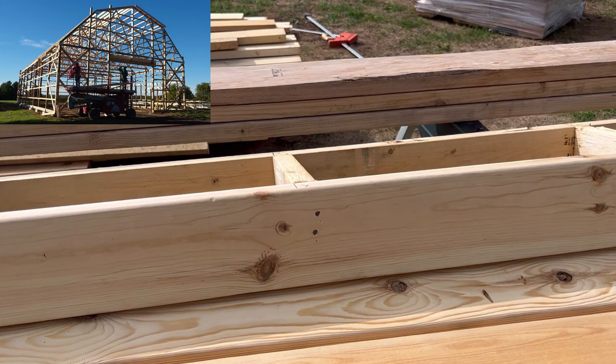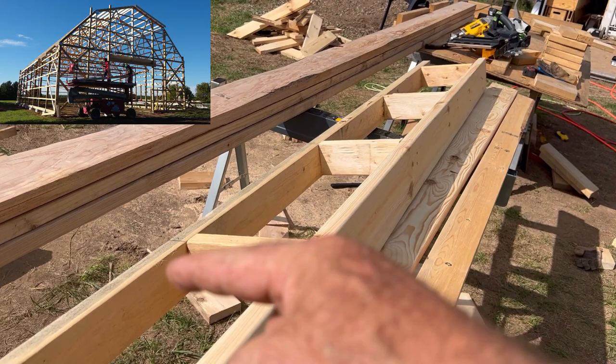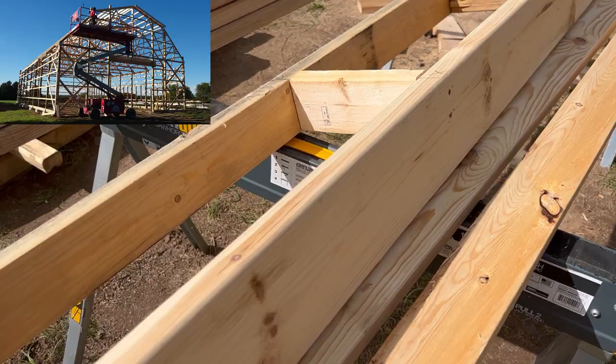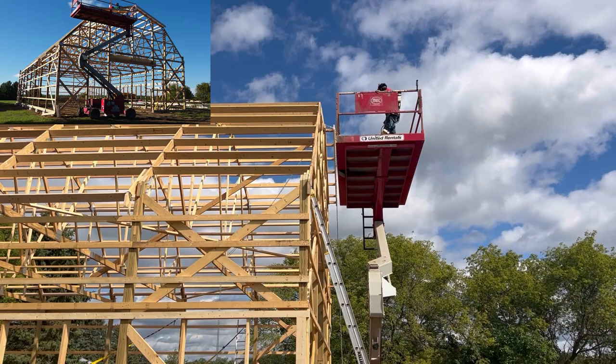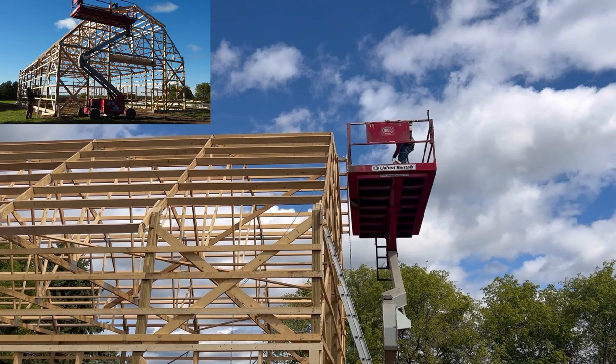I'm pre-building these ladders which are going to be our gable overhangs — these are 12 inches and will have the same spacing as our purlins up top. The guys up there are getting ready to put those into place. They've got one in and are getting ready to drop the other side. We'll get the uppers done and then come back and do the lowers after that.